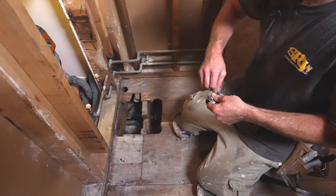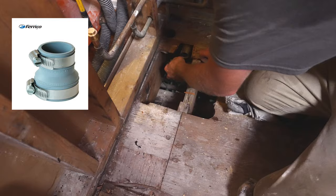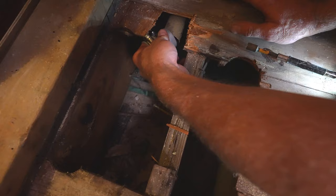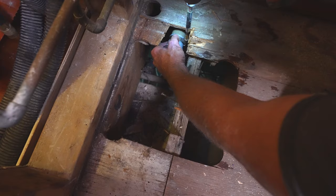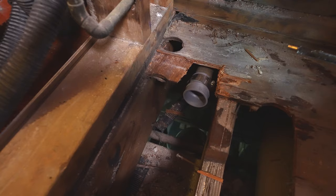Now when you have inch-and-a-half copper, it's nicer to use the inch-and-a-quarter to inch-and-a-half coupling. It's just a nicer thing to use the inch-and-a-quarter fitting on here. So we're just gonna stick this on there because it's a little more difficult to do it after the tub's installed. But then we'll connect the P-trap after we get the drain assembly in. This part can be connected from our access panel here. I just wanted to prep this so it's a little bit easier to put together.